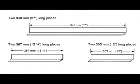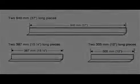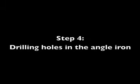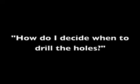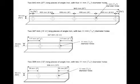2 pieces should be 940mm or 37 inches long. The next 2 pieces should be 387mm or 15¼ inches long. And the final 2 pieces should be 305mm or 12 inches long. Next, you will need to drill holes in the angle iron. Take a look at the manual to see where the holes should go.